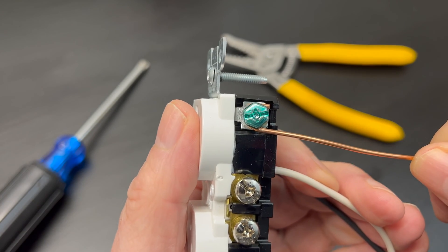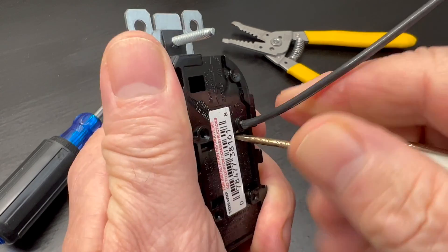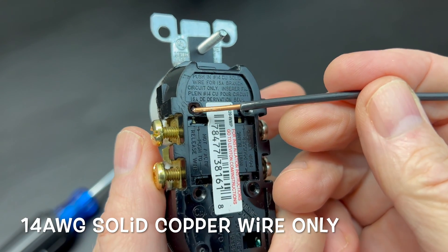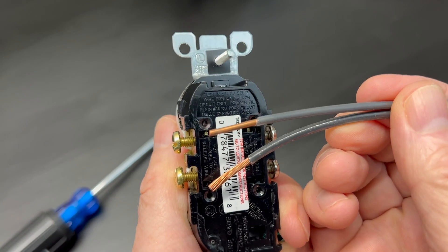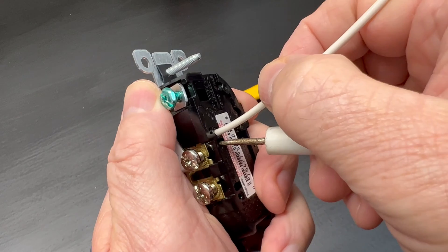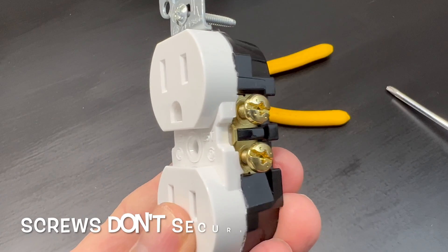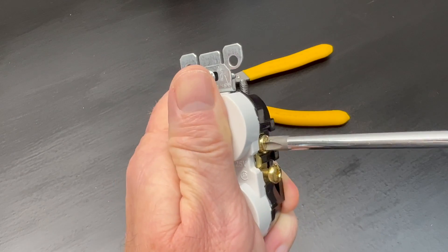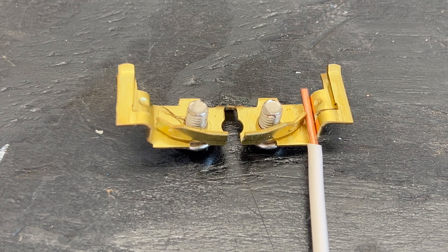We will still need to make a J-hook to connect our ground wire. To remove the wire, you insert a small screwdriver into the little release tab, pull back on the wire, and it should pop right out. There are four important facts about backstab connections. First, they're only available on 15 amp residential grade devices. Second, they're only rated for 14 gauge solid copper wire — if your circuit is run in 12 gauge or stranded wire, these connections cannot be used. Third, they're only rated for one time use; once you remove the wire, it cannot be used again. Fourth, the screws are not part of the stab connection — they should be tightened down so they're not sticking out, but they play no role in securing the wire. The issue with backstab connections is the very small surface area that actually secures the wire, so over time that can become loose, get hot, start working intermittently, and eventually fail.